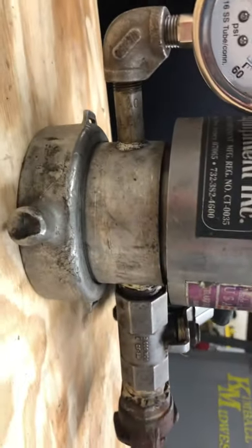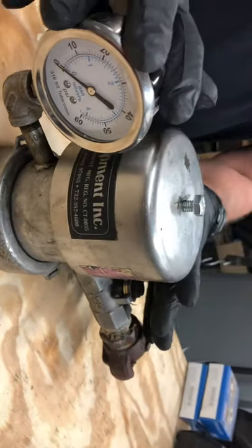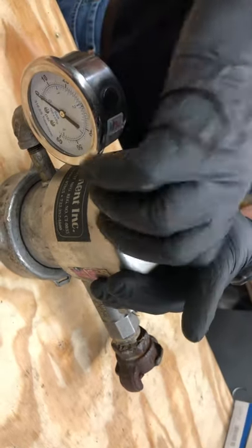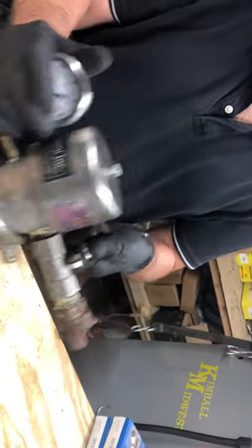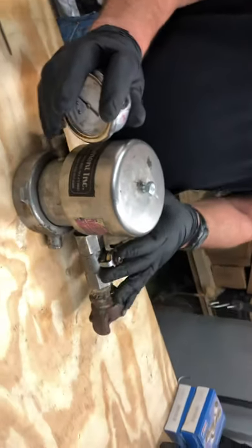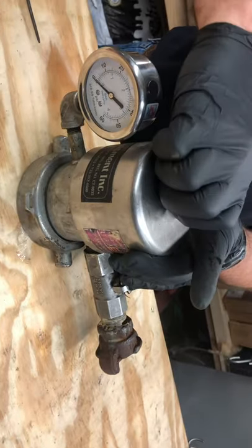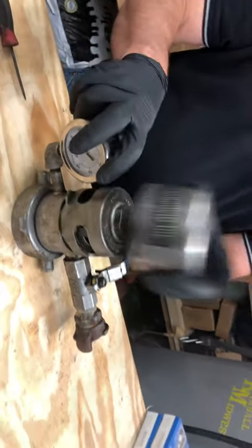The first thing you want to do is take off the screw. Do not disassemble this on the trailer — take it off the trailer. You can see from this valve right here, this is a washout cap. Unscrew the cap from the trailer because if you don't, you'll lose the internal parts into the tank. So once you get this sitting on the ground, this is how I want you to do it. Take this off — it unscrews with just a simple bolt — take the bonnet off.